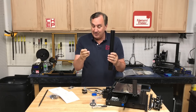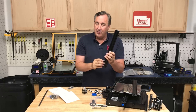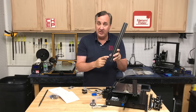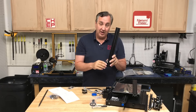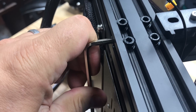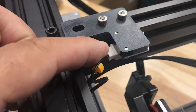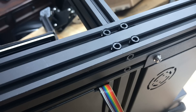The manual asks me to install the stop switch for the Z-axis but we're going to adjust this later. I'll put it on loose — there's actually a clip here that hits on the rail to stop it from going down too far. I've had to cut that off on some machines so we'll leave it adjustable and tighten it later. There are two screws that go up from the bottom, and keep the wires away so they don't get pinched underneath the rail. This is a good time to connect the Z-stop switch.